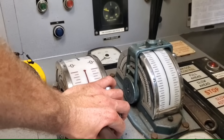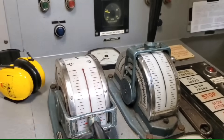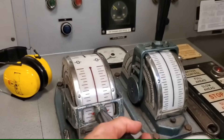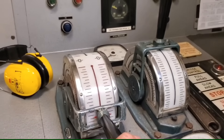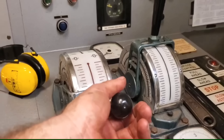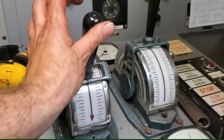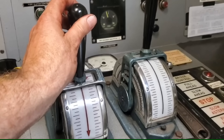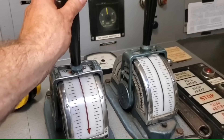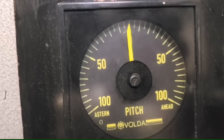You always start them locally then change to bridge control with them running. Stern pitch doesn't go to 100% in astern. Regarding the selector for main engine start — I've been away from the ship a long time. That's just a selector, so when you select it you're able to start the main engine. That's probably why we had to use that master valve earlier in the other video.